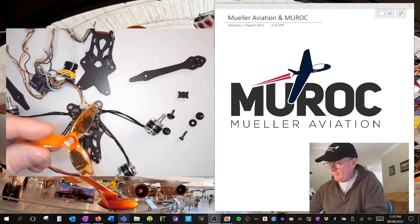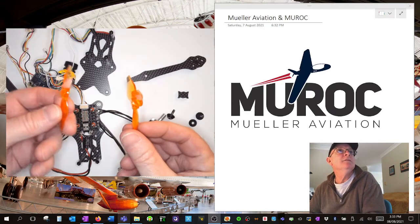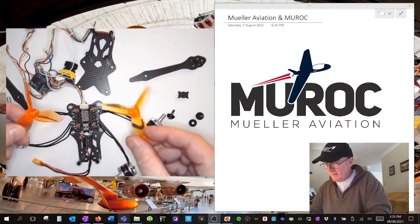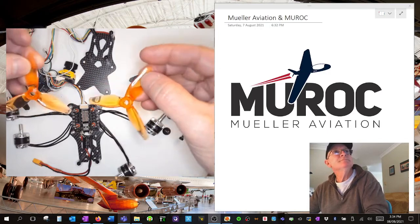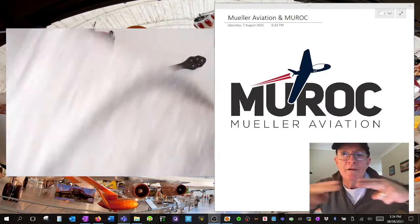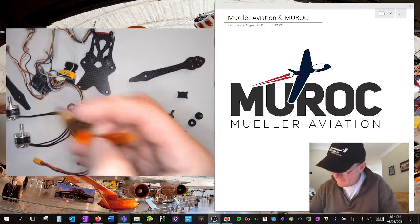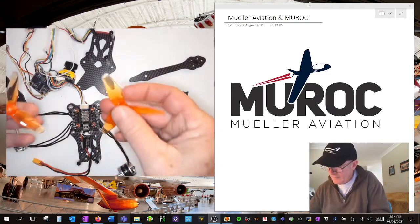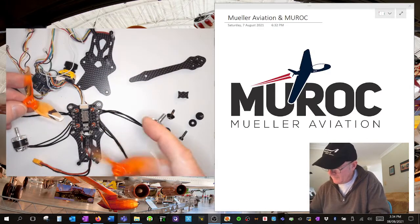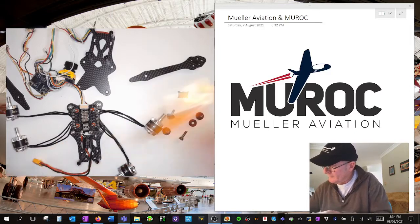And for this particular aircraft, there's a picture of the two front blades, the left and right blade. You can see them. See the pitch on the blades? And they will turn that way. Remember I mentioned a crab feeding itself. Goes that way into its mouth. So they'll go that way. Not all drones are like that, but lots are. And probably the bulk of drones, the front two motors spin that way. And the corner motors, the diagonals, are the ones that spin in the same direction. Top left, bottom right. Top right, bottom left. Spin in the same direction.